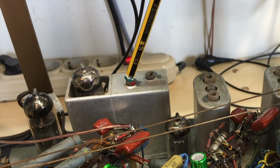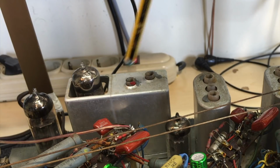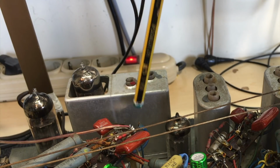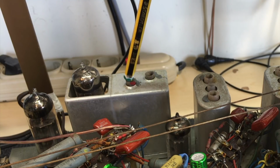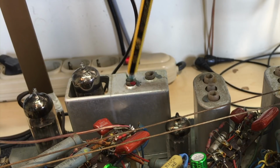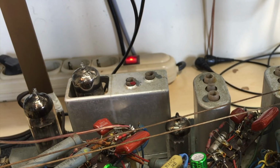The other way of doing it, the simple way of doing it, is when looking at the sine wave on the scope, align the bottom one to give the best sine wave. In other words, the least distortion. That's really what you're doing when you're aligning the discriminator coil. So I align that and I get a nice sine wave on here.